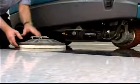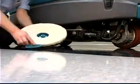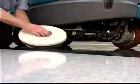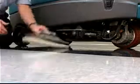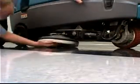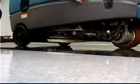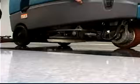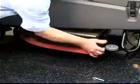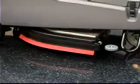If installing a pad driver and the pad needs to be rotated or replaced, squeeze the spring clip together to remove the center disc. Flip or replace the scrub pad and center it on the pad driver. Reinstall the center disc to secure the pad in place on the pad driver. Place the new scrub brush or the pad driver onto the drive hub and lift it into place. Then ensure it is securely mounted on the hub. Close the side squeegee and the retainer pivot. Then insert the pin completely through the bottom of the assembly.